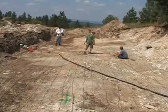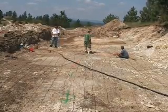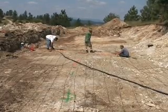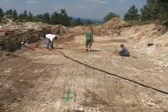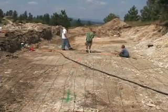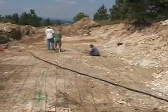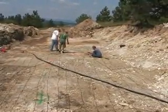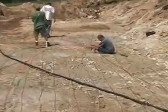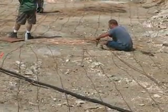We're going to be bedding it in. We've got the excavator here right now to start putting dirt back in. This is real rocky soil, so we're taking the precaution to get sandy dirt around the field to protect it. Steve is working on the manifolds in the center area — getting the tubing cut, reamed, and fit together so they're ready to braze. Then we'll flow the nitrogen and braze them all up.